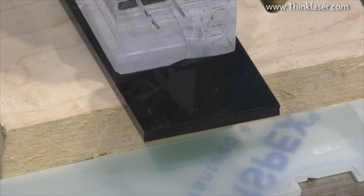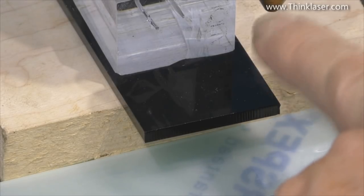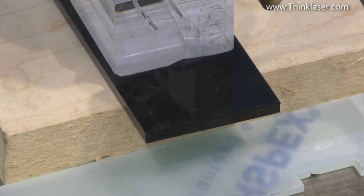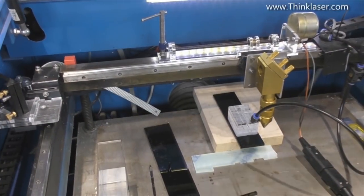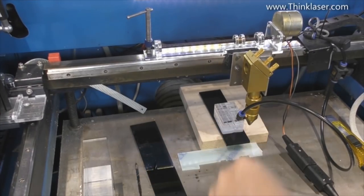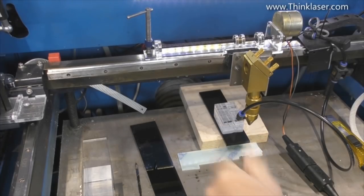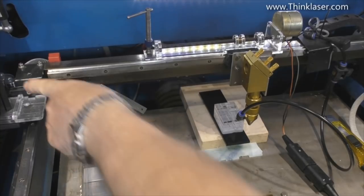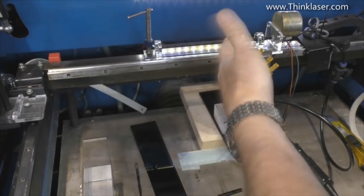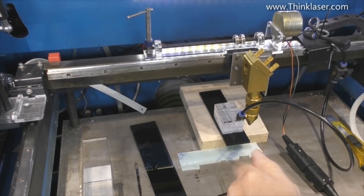We're going to see whether 70% power is enough with this huge focal distance to burn through approximately 5.5mm thick acrylic - with almost miraculous results. Having established that we've got a lovely soft cut with that lens, I now want to do something completely different. I've programmed the machine to draw a line. If I press the origin button I know I'm going to get no movement in Y - the machine doesn't know where X is, and when I run the program the X drive will run but there will be no motion in the head.